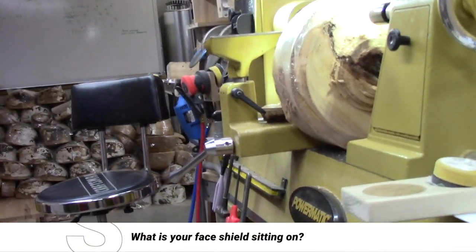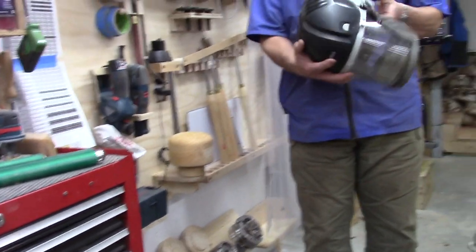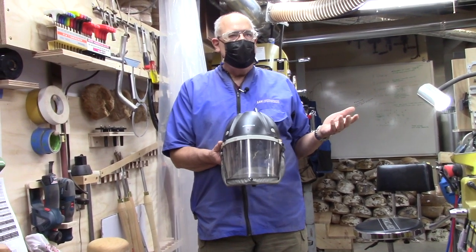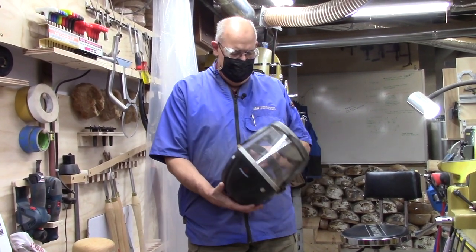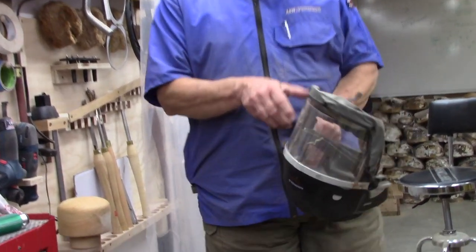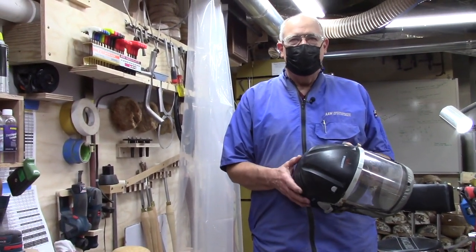Someone asked what my face shield is sitting on — it's sitting on a homemade head stand. This is an Air Shield Pro. I talked to Ron Marcus about his; he was smarter than me and bought a different brand that's quite a bit more expensive. It always amazed me that something like this sells for over three hundred dollars, yet competitors sell for three or four times that. This one is fairly light, though the head setup could be more comfortable. The biggest deficiency number one: the impeller that blows the air is very fragile — it fell off a lathe extension about two feet off the ground, hit the floor, and that was the end of it. It's far lighter weight than it needed to be.